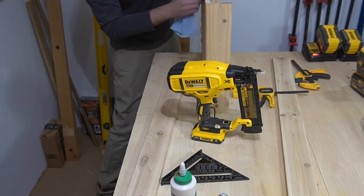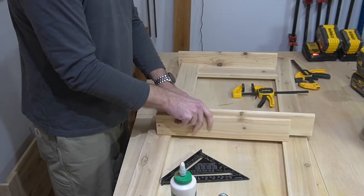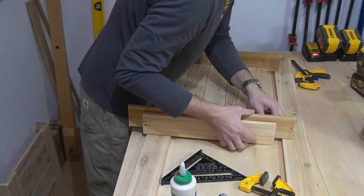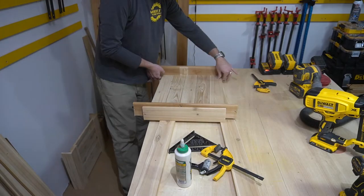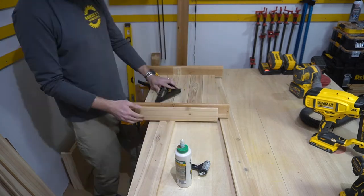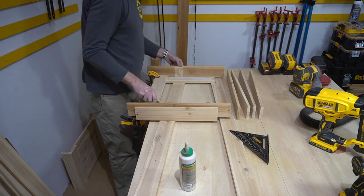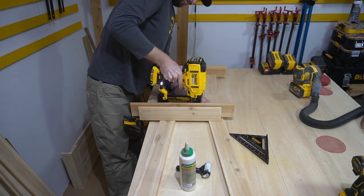Using the brad nail makes it a little bit quicker while the glue dries — you have it pretty much secure. Wipe the excess glue. Using spacers to line everything up makes assembly so much easier. There are my two pieces as spacers — align everything, make sure it's square. Clamp at least one side down so it won't move. Once you're ready to glue, spread it nice and even, get all the planks back in, everything aligned, and just brad nail them in.